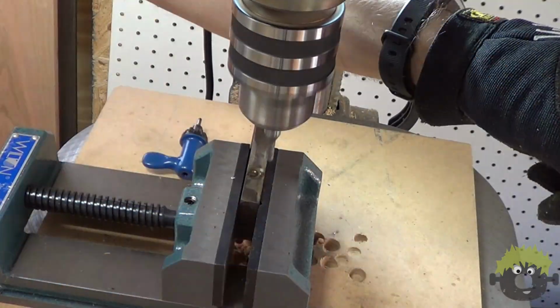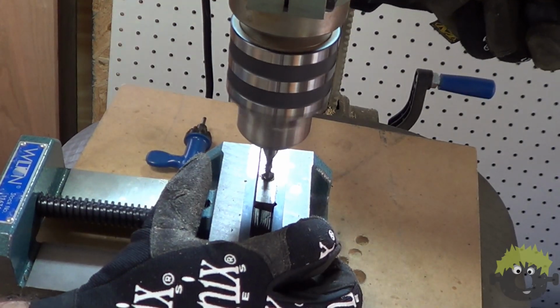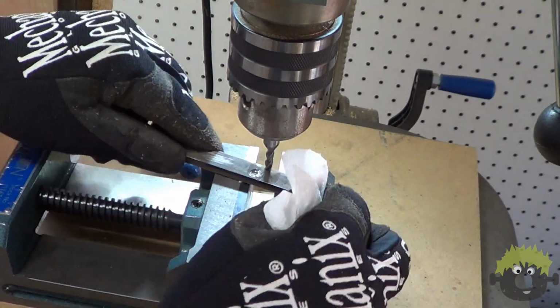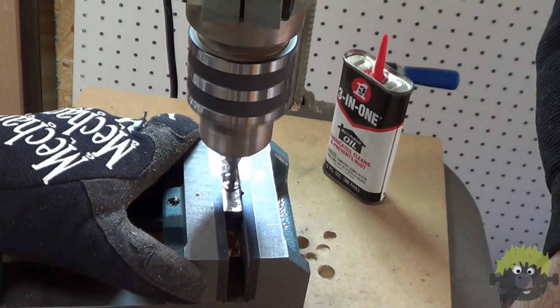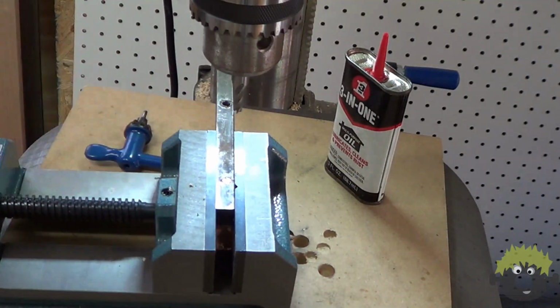I ended up grabbing an end mill and milling the tops of the bolts dead flat. I could then dimple the bolt with a center punch and drill a straight hole. I went back and forth between the drill bits and a screw extractor, trying in vain to back the bolts out. In the end, none of them budged, and I had to completely drill them out and re-tap the bolt holes.